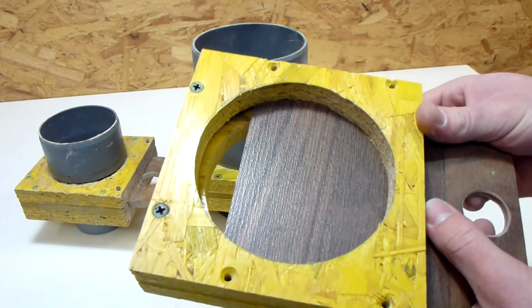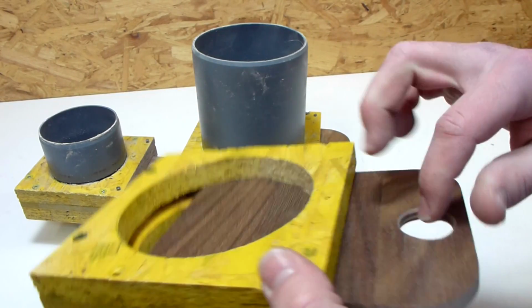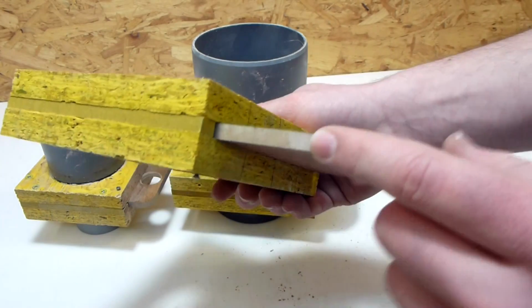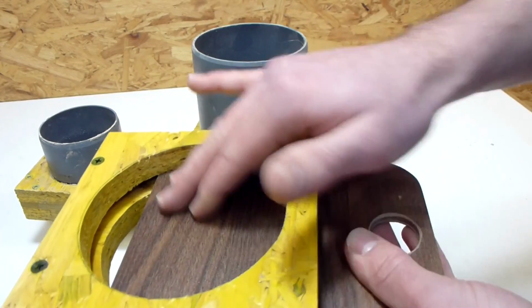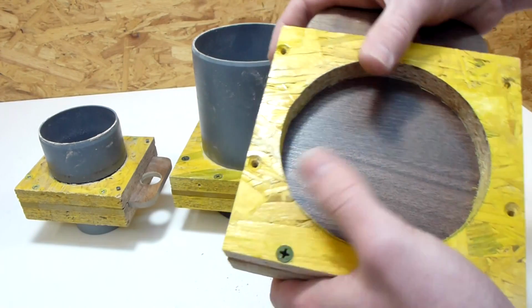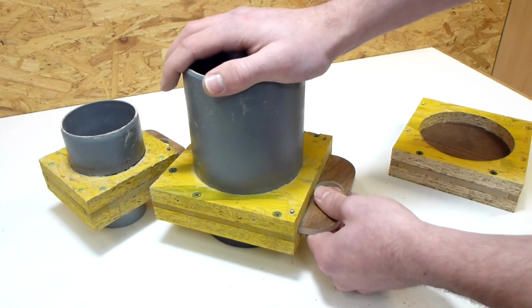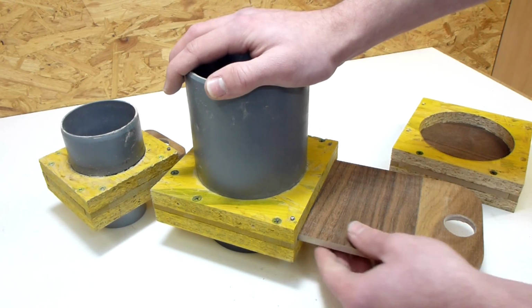And the reason why I don't have this problem is, I think, the material I used for the slider. This is laminate flooring, which basically is laminated MDF, and sawdust just slides really easily on it and can't affect the sliding action very much. But the sliders still have some friction, so they will never shut by themselves because of vibration.